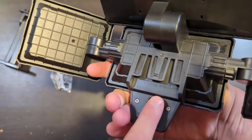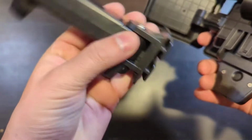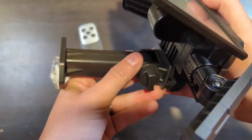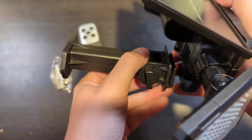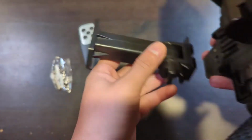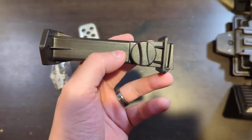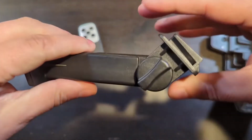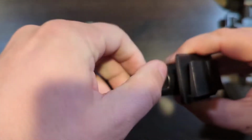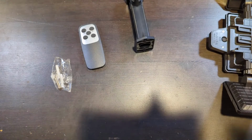And then on the back of the unit, you've got the little clip here, which is essentially the inverse of this little extension unit. And that is just going to slide on and click. But you want to make sure that you slide on and click this after you have this mounted to wherever you're going to mount it, because it's going to be really hard to get a screwdriver behind that once it's all connected. And you'll also be able to loosen the thumb screw, and then you can point it up and down as well. So no matter where you mount this, you should be able to get light to where you want it to go. So let's install this outside, and then I'll show you how real simple it is.